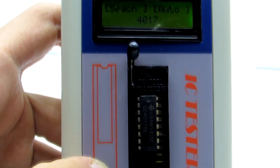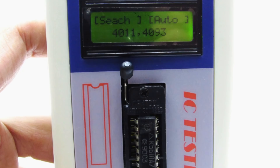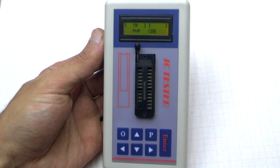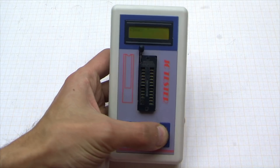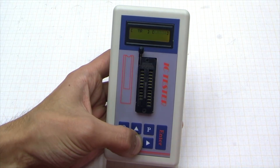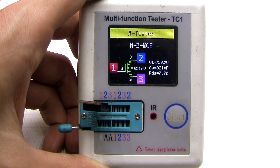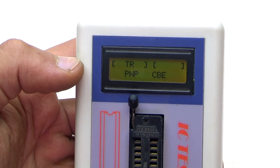The firmware of the tester contains thousands of algorithms and parameters of hundreds of various components, so it is almost a computer. I think about the chips everything is clear — there were no serious problems with the correct definition of components and no doubts about the truthfulness of the results. This device can detect any transistors of any conductivity. The transistor pins must be set to the specified holes numbered 10, 11, and 12. Then turn on the device, select CHECK of the transistors, press ENTER, and the component will be instantly detected. Unlike the usual transistor tester which displays almost all parameters, this device shows only the structure of the transistor and pinout of leads. In some cases, this is quite enough.